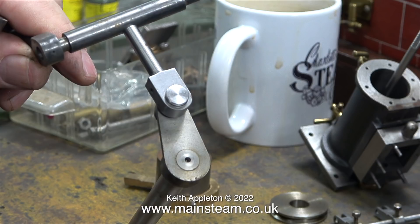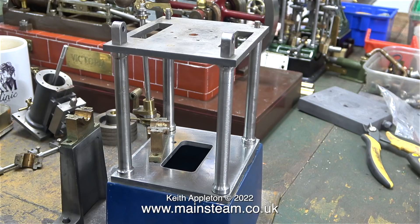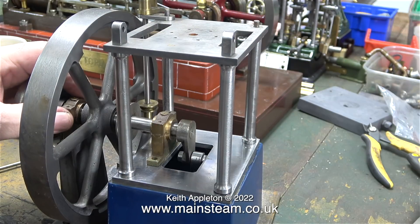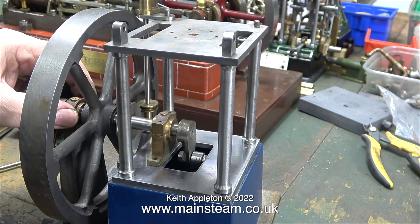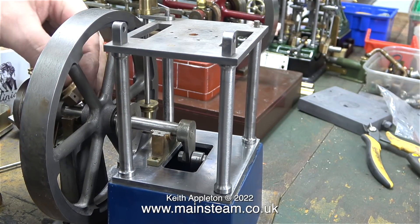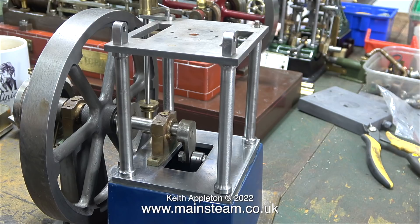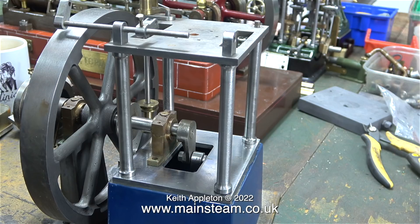The length of the connecting rod overall is critical, and this connecting rod is made of three separate pieces. Here's a shot of the main bearings in their approximate position — the good news is these castings seem to have been machined okay. Although you can't see it very clearly, the two rounded steel blocks at the top of the columns which support the rocking shaft to operate the valve system are very badly pitted indeed and look like they've been shot blasted. This all seems to me like parts of this engine have been stored in a very wet environment. It's not the end of the world and it's fixable, but it's going to take time. I would definitely make four new support columns because these just don't look right — they don't all look the same.